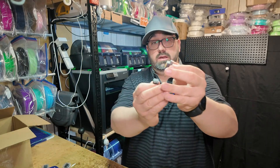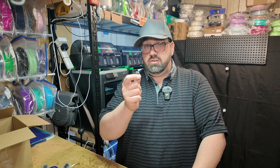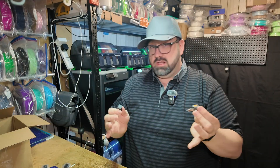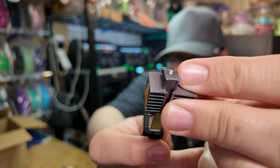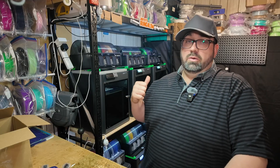So the G-code not only increases the amount of passes it does, it also slows down the speed at which it passes. For me, this already made an improvement out of the box. Now that I've been running the G-code for a little while, it's made a vastly bigger improvement as well. One thing I'd like to do with the G-code is instead of just having it go like this, I'd like it to maybe do a bit of a circle — get it moving diagonally — and I'll do an update in a future video. There are links in the description for all of this stuff. Don't feel obligated to use those. Let's go and do an install.